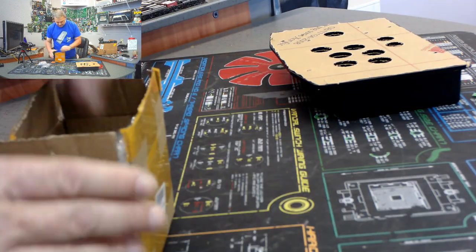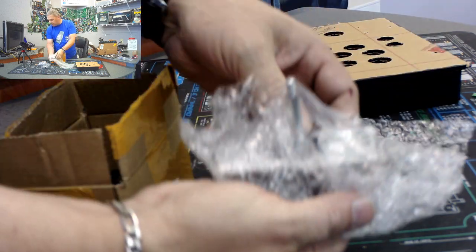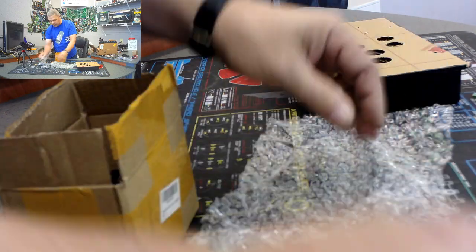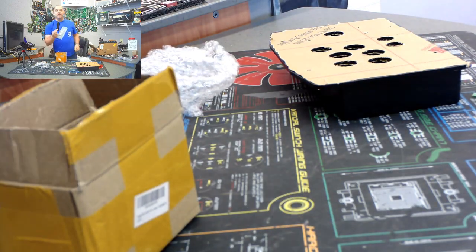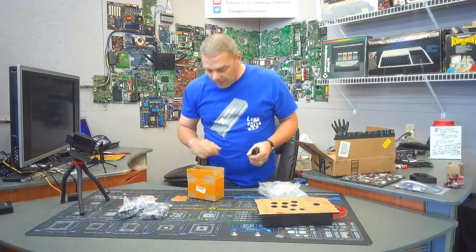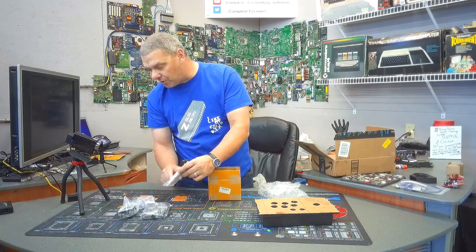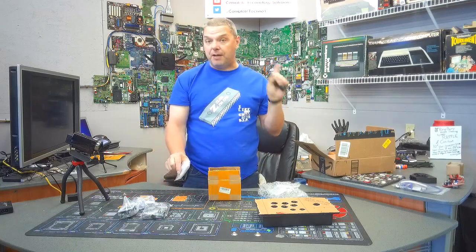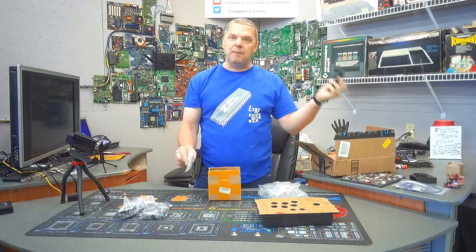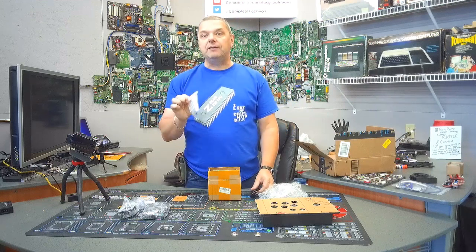We've got all the buttons in there. And this appears to be the joystick mechanism — yes it is. And that's micro switches, guys. That's actually a good joystick; that should work really well. Now this is the important part. So the way these work — look here — a very familiar board, guys. This is that controller board that we used on the Arcade 1-Up a couple of videos ago. If you haven't seen that one, take a look down in the description — I'll put a link to it. This is what's going to give us the ability to connect this directly to the Raspberry.